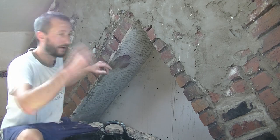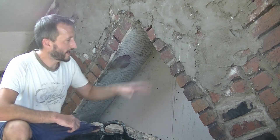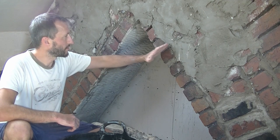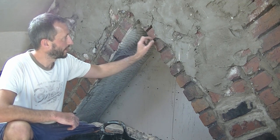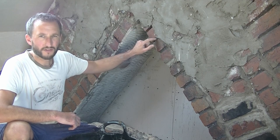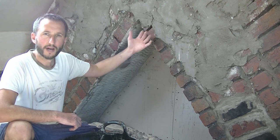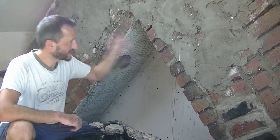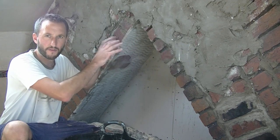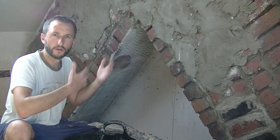Yeah, same technique. I'm going to flick it on. Seems to be best. It's throwing it right into those mortar joints then. If you use the trowel, it seems to be brushing over these joints because they're so deep. So what's happening is every brick width, you've got this bit that's not adhering properly. It tends to slump and want to fall out. So by slapping it in, leaving it there for a few seconds or a few minutes, it's getting a bit of a bond. Then you can go over it with a trowel. That seems to be working.